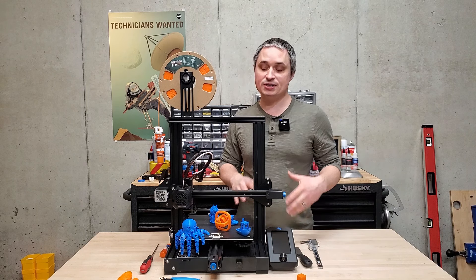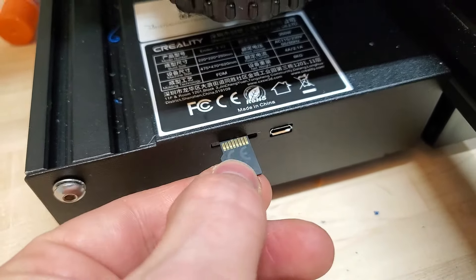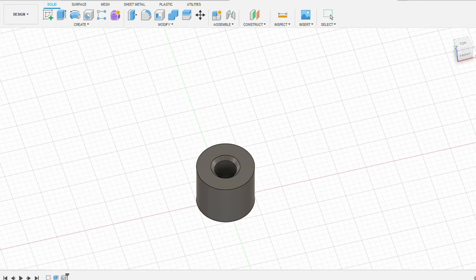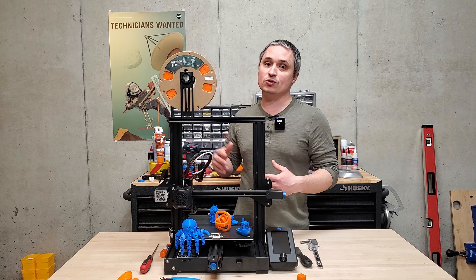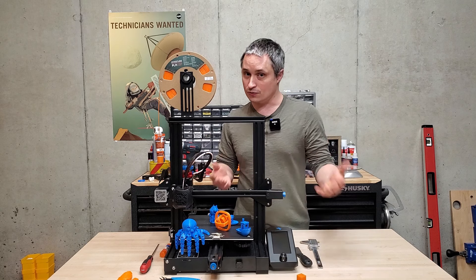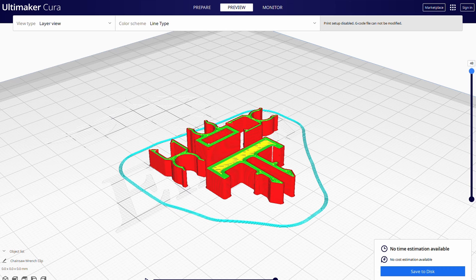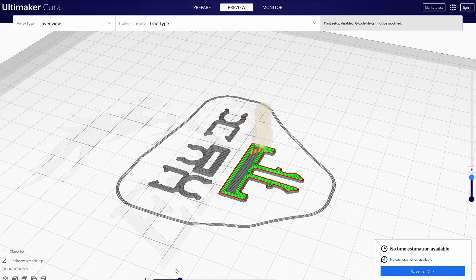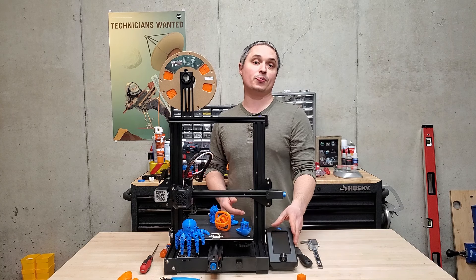The process for printing and getting a model loaded on is really simple. It comes with a micro SD card and a USB adapter. You can either make your own models in something like FreeCAD or Fusion 360, make an STL file, and send it over to a slicing program like Cura — all of these are free. The slicer takes that 3D model STL file and makes it into a g-code file, which is a toolpath file directing the printer where to go and how much to extrude for every layer. Once you have your g-code file, you put it back on the SD card and start the printing process on the printer.